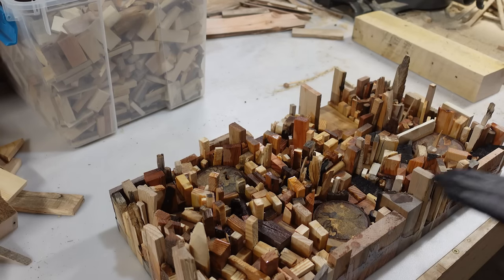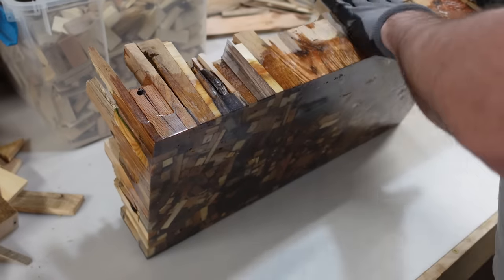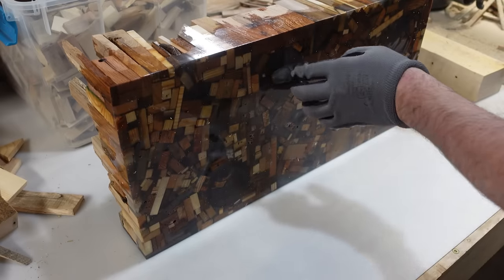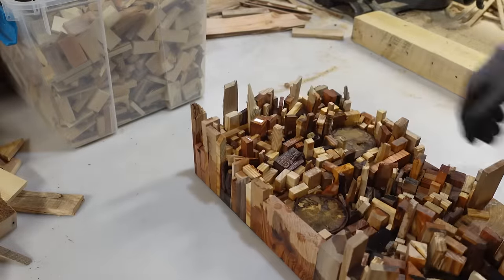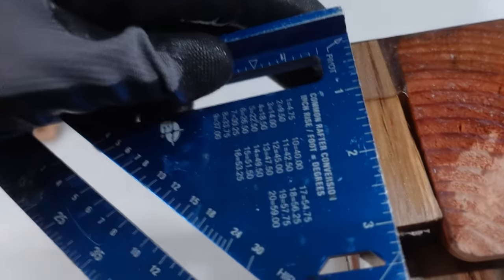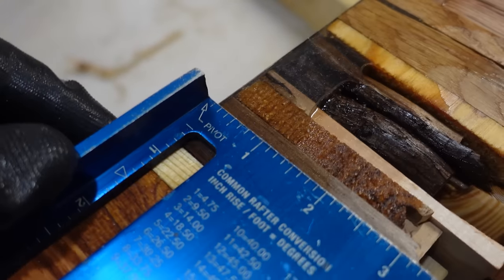We're gonna have to figure out a way to trim all that off and then plane it down to about 1.5 inches. And it looks like we got a solid where it has settled. That looks like a pretty good inch there. So we might have to do some infill, or we might just go to 1 inch. I'm not sure. You got some waviness on the bottom. It looks like a city block or something, like a cityscape. Looking over this, and it looks like where it settled, we're at about 1 inch the whole way around.